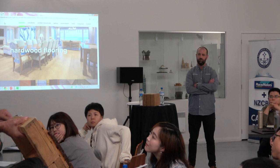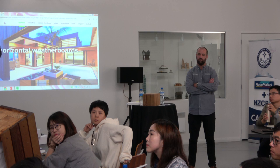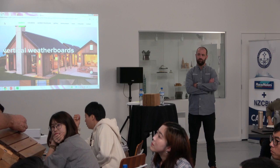So what's the purpose of the drip edge? Again, we're trying to protect the framing. The thought process is that if we don't tell the water what to do, it'll do what it wants to do. So what we're trying to do is tell the water where to go. We want it down and off. If it runs down the edge, the chances are it can track back and then back up. It's called a wicking process, and wicking can go up 300 to 400 millimetres. It can be drawn back up like a straw, sucking the moisture back up into the frame. So again, we're trying to protect the frame. By creating a drip edge, you're making sure that the water comes to the bottom, gravity takes hold, and it falls to the ground rather than tracking.